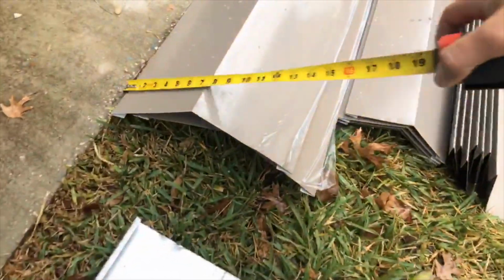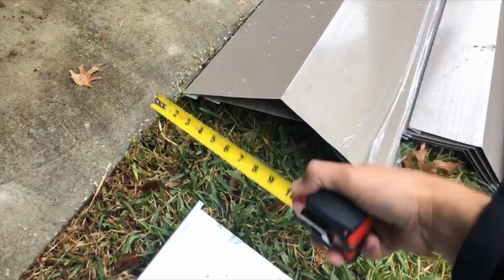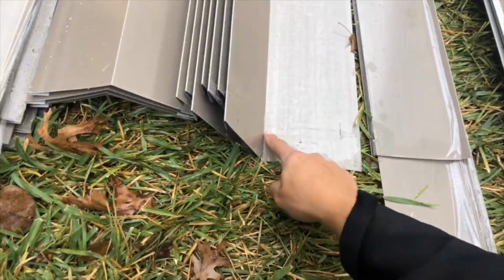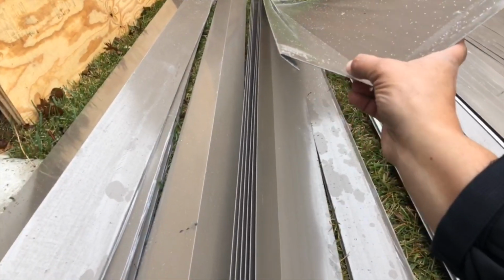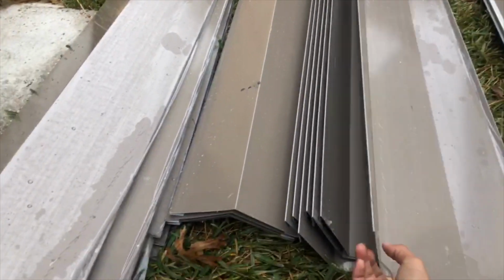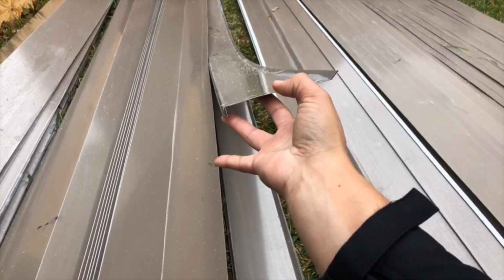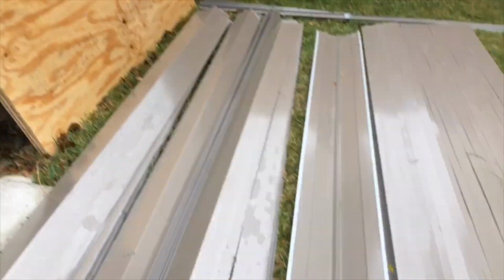So on our ridge caps, we do a 7-inch offset or face with a 1-inch hem. Right here on our ridges, we do a 5-inch. Okay, this is the head wall flash. So this piece right here actually goes mounted to the wall, right? And it goes just like this. This piece goes on the metal, and then this 1-inch little piece goes on the Z-bar, and we'll talk about that when we do the actual install. This guy right here, this is the counter flashing, and this piece right here, that goes into the chimney. And there's the chimney right there, not that big.